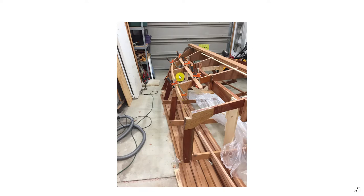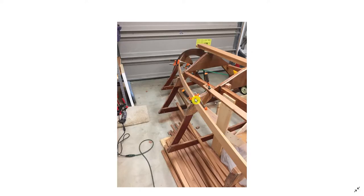Here I'm test fitting a piece of the chine log — just half a piece before I glued the scarf joint — clamped in just to see how it's going to take the bend. These are finished four-quarter stock, roughly three-quarters of an inch thick, and it's a pretty tight bend. Unless you have nice straight-grain wood, you could have some breaks. One option is to use thinner pieces and do three laminations instead of two — in the end you want roughly an inch and a half thick chine log, as the plans call for two laminations.